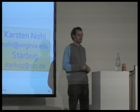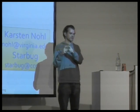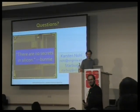So we could take our approach one step further, where we don't say we need to first categorize logic cells into functions and then find these functions across the chip. We could, one by one, reverse engineer the functions themselves automated. We didn't need to do that yet because everything that we see is standard cell libraries, but it's just one more step in the reverse engineering. It doesn't make it very much more difficult.